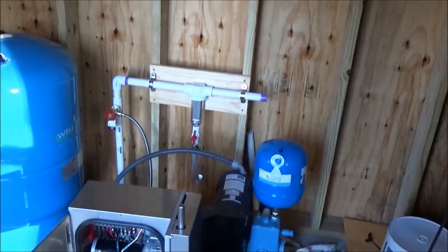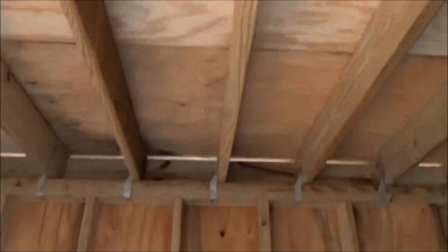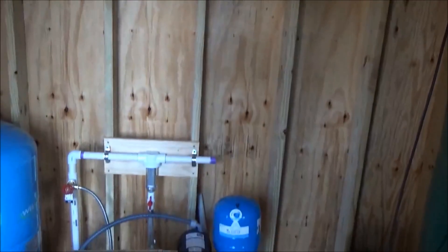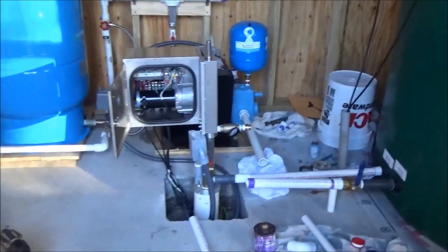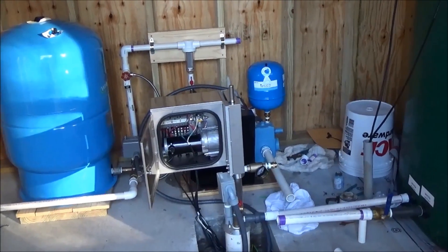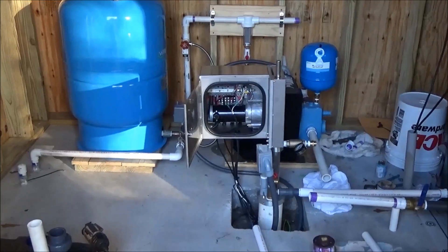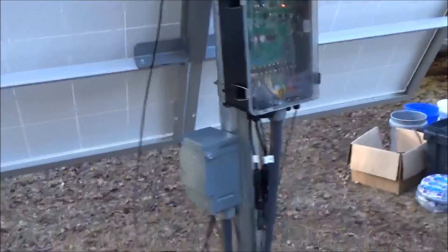One of the key things is ceiling height — we didn't have to remove the roof or drill holes because we had enough height. To get the simple pump in, you need ten and a half feet to clear the pumping cylinder and drop pipe — we had two inches to spare. Being able to go back and forth and fine-tune the design saves days of labor and tearing up the existing structure. For long-distance projects, we're happy to walk you through how to do one of these systems and supply all the equipment, design, and installation guidance.